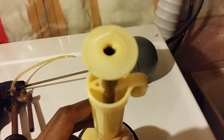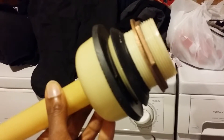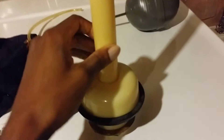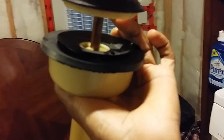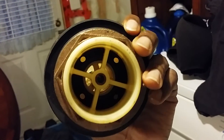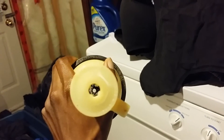And this also came with the Mansfield flush valve. It's a nice older canister one. The rubber actually seems to be pretty good on it — it's a shame I don't have proper light. You can see it right there. The rubber is actually quite soft — very soft rubber. And the copper tube going right through to the bottom. And then you stick the refill tube in there and it goes all the way to the end.